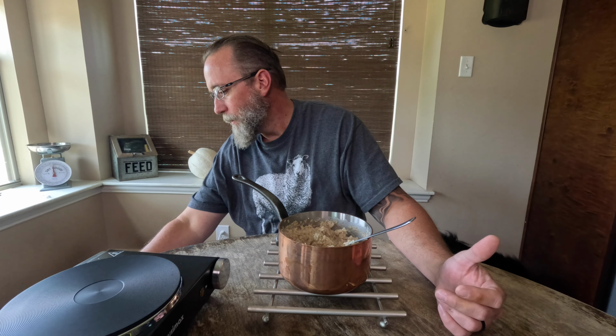So if my inverter is going to pull 1400 watts, if I didn't have a 2000 watt inverter, or at least a 1400 watt inverter, that's not really a thing, it might not have been able to run, right? So you need to have an inverter large enough to run what you want to run, and then enough batteries that it'll last, right? That you can actually finish the job. So in this case, 1400 watts, 10 amp hours, and you've got a tasty breakfast.